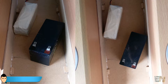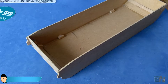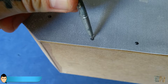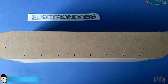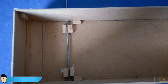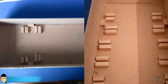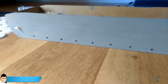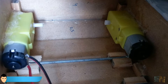I let the base dry for the entire day under pressure using some heavy batteries. The bottom base is glued and ready. Using the dots from the printed paper I marked where each screw fits, then removed the paper and drilled all the holes carefully. I fit a long 3mm screw in each hole and glued four wood cubes around each screw inside the base box for better rotation and stability. Finally I painted the base with gray acrylic paint, drilled an 8mm hole for the gear wheel, and glued in place the two geared motors.